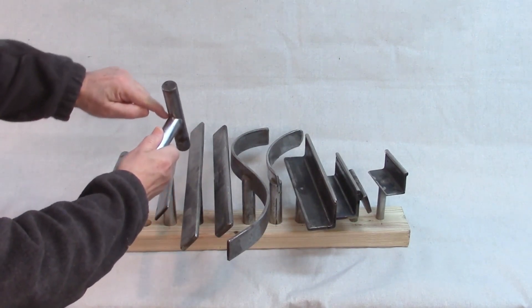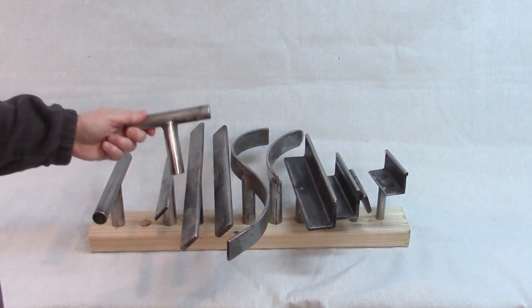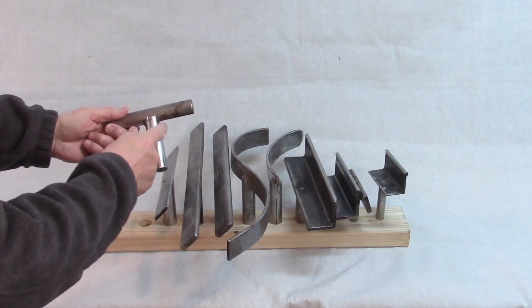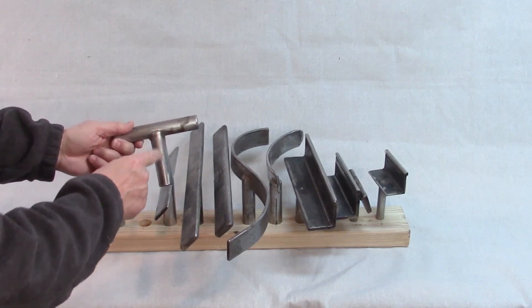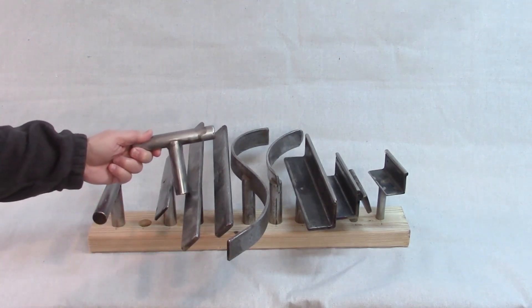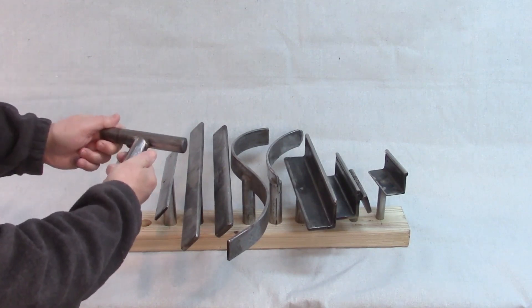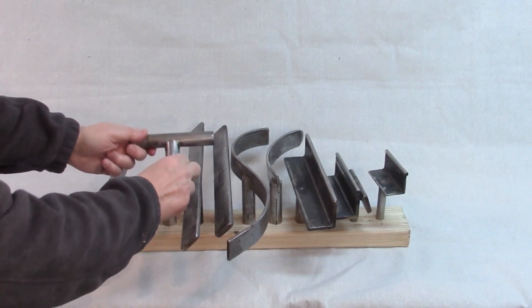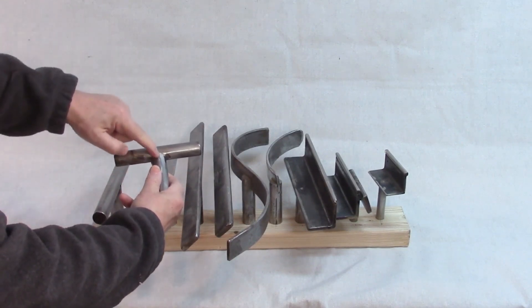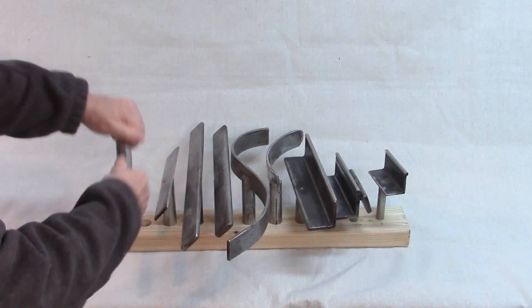It's difficult to cut that curve into this top piece. And once you get it cut, you really need to smooth it down good so that you get a tight, smooth fit between these two bars, because silver brazing does depend on having a close fit. So this was kind of difficult to do. Also, when you get ready to braze it up, it's kind of hard to keep this piece perfectly perpendicular to this piece — not impossible, of course, but a little bit difficult.